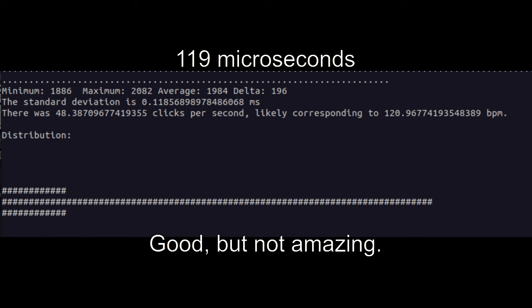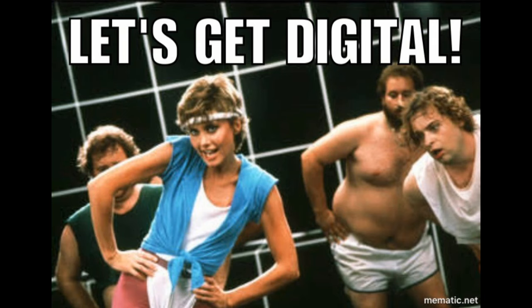No, it's fine. Ableton just sends the MIDI clock, or rather, in Ableton you can choose if you want to send MTC or MIDI clock, but the Yamaha RY30 always sends both, and I can't find a way to change that. So I spent a lot of time editing out the MTC signals from the test file to check, and the RY30 still didn't impress, so I'm not using that one. And MIDI timecode never got very popular because it's designed to sync physical hardware and didn't come around until 1989. 10 years later, everybody had switched to DAWs anyway.